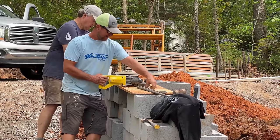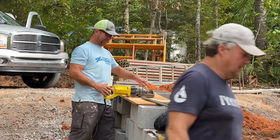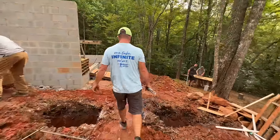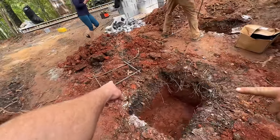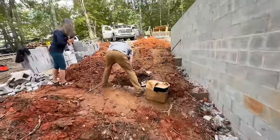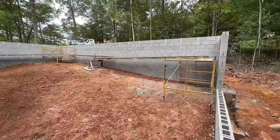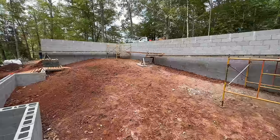These tiny guys are for making little grids in the footings — we'll wait until the concrete's in there. For anyone's reference, a wall like this with steel in it — just the code — is good for seven feet of backfill. If you do 12-inch block plus just the vertical steel you can go up to eight feet. It doesn't add as much as you'd think — it's like a sliding scale.